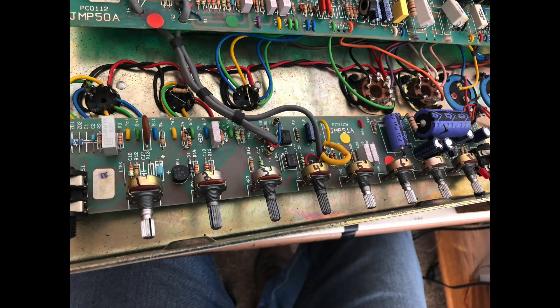Another thing I did on this amplifier was pull the board. I had labeled the pots — I was going to take them out, take them apart, and clean them, but I just sprayed them out and that helped a lot. The second pot, the gain pot, was almost unusable. When it was on the light bulb limiter you could turn the gain and the light bulb would actually go dim, so I thought I might be on to something in the preamp with that — but it turned out it was not. Got the pots clean and they all work really good.